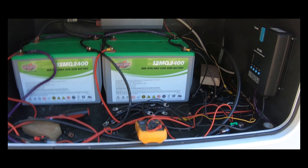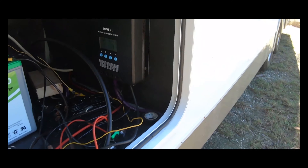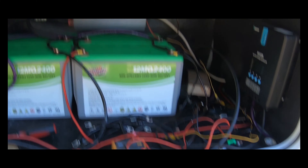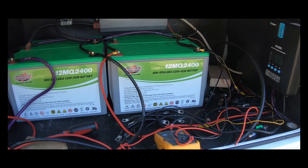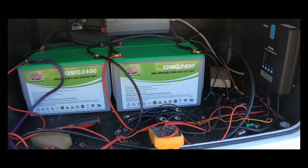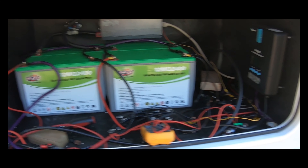This is a good point of why you should always watch your battery bank and your charge controller — make sure that you're reaching full charge whenever the sun's out. That's how I picked it up: I realized three days in a row I hadn't reached anywhere near full charge, so I knew something was wrong. I went ahead and pulled it all down, and sure enough, one of the batteries was bad. That's how I found and diagnosed my battery bank problem. You've got to remove the bad one — it's like cancer. Pull it out and delete it essentially.